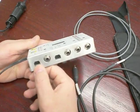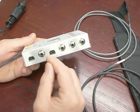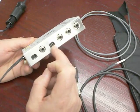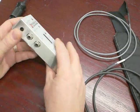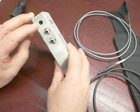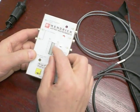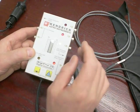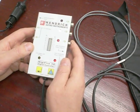We also have two inputs on this controller. These are for the temperature sensors — the external sensors that go to your optic or your devices, or whatever it is you're trying to keep warm. This sensor input is for output one, and this sensor input is for output two. Outputs three and four cannot be controlled using temperature sensing mode. On this side of the controller, there is a small hole in the chassis, and behind that hole is the sensor to measure the ambient air temperature. It is the difference between the ambient air temperature and the variance programmed into the controller at your surface or optic that enables the temperature sensing function to keep that device above the dew point.